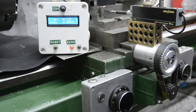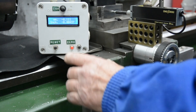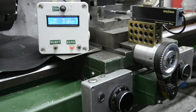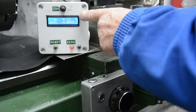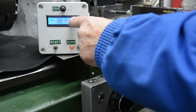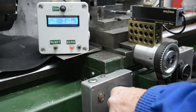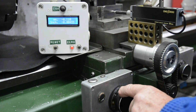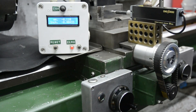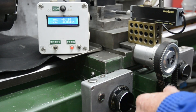The next measurement I want to make is to get some idea of the backlash. This has all been moving in one direction so backlash wasn't relevant. This is set on 111, so I'm going to wind the control backwards until this starts to move, and the delay in doing that is the backlash. Nothing, nothing, nothing — there, it just started to move there. I'd moved the dial about 28 clicks, so on that basis it's got about 0.028 millimetres of backlash.